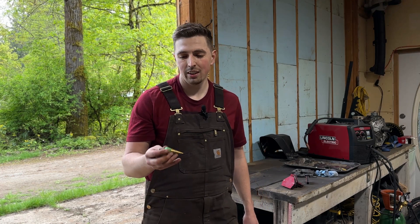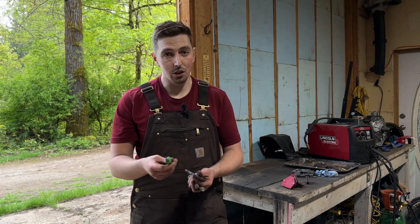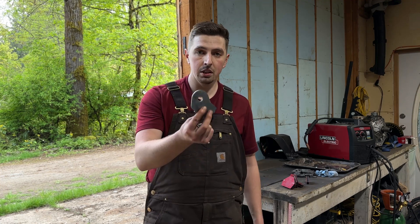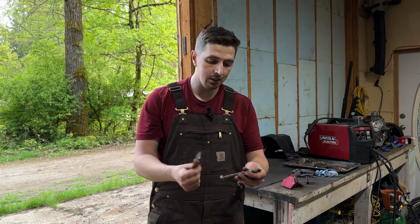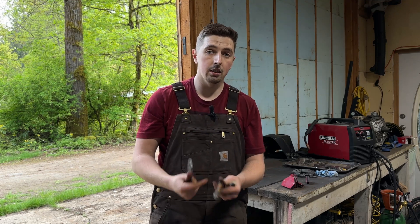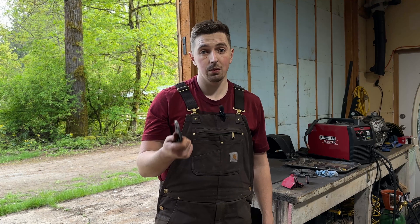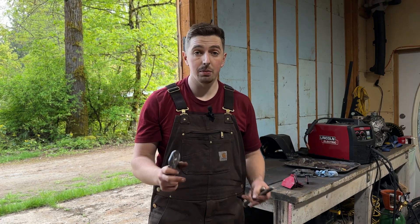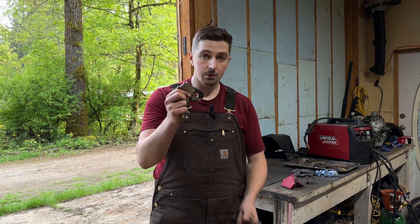Unfortunately the step drill did not work — not even close. I even tried on a drill press and the hand drill was nowhere near. So I can't really open these up to fit my 5/8 bolts. I scrounged around the shop and could only find half-inch bolts, but they have too long of a shank — the shoulder is too long to actually thread the nut down all the way. So my plan is to tack up the rest of the mount and make a run to the hardware store to grab some half-inch bolts to suck everything together so I can finish tack welding and at least get the links tacked up underneath there today.